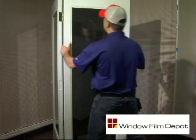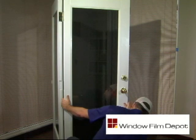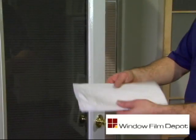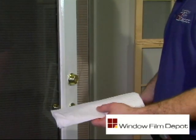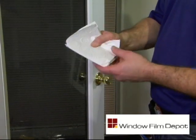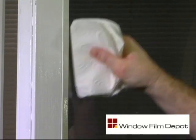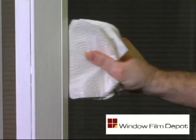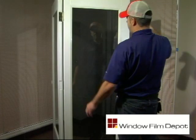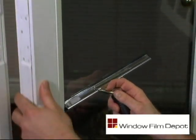Re-check the window to ensure the film edges are all laying down on the glass. Take your paper towel and wrap it around your white card. Bump the edges of your film with the wrapped white card to remove and absorb any excess water on the edges. Wet again and squeegee the glass clean from top to bottom, leaving the surface clean and dry.